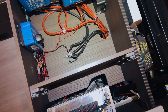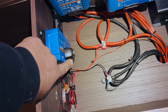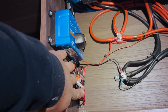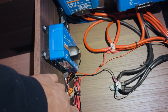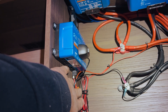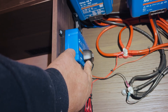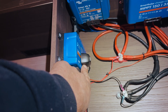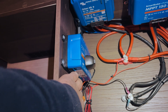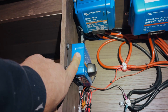So here's where most of the equipment is. We've got the Cerbo GX with the switch that I've mentioned before. We power through these Wagos — drawing power for the servo itself, and the cables we've run for the screen are on the same circuit, all running through this switch. So if you need to power cycle the servo and the screen if it's frozen, the customer can just flick the switch rather than unplugging and trying to get it into the right holes. So that's the Cerbo all set up.